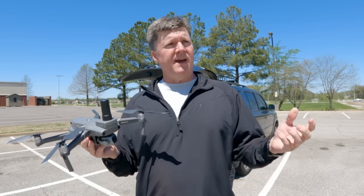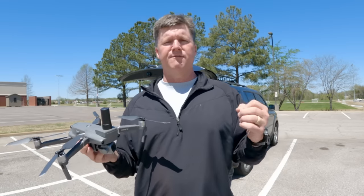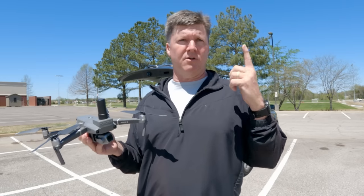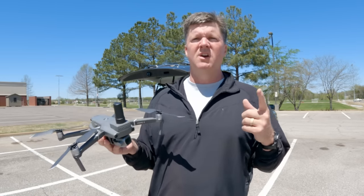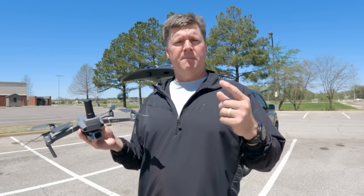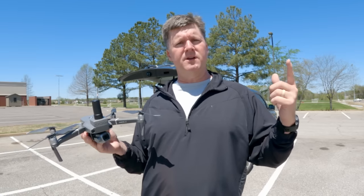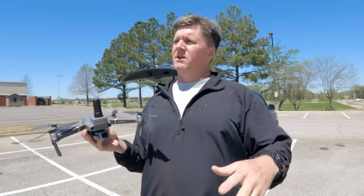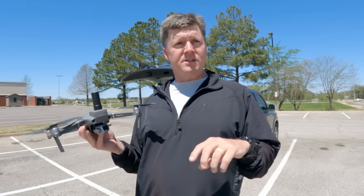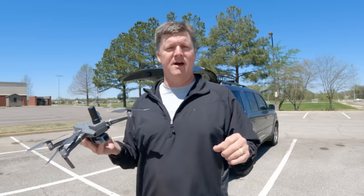But you also need to have a unit that you can check ground control points with. At the very least, you still have to have one GPS unit, like the RS. I would still recommend the RS2. You could get away with using the Emlid M2 and put on a Swift GPS 500 antenna. That'd be a little cheaper than the RS2. Wouldn't look as glamorous, but it could probably still get the job done.